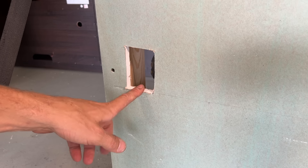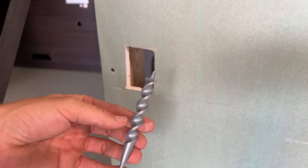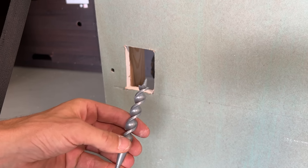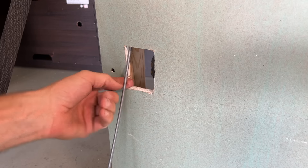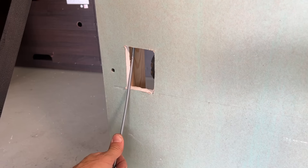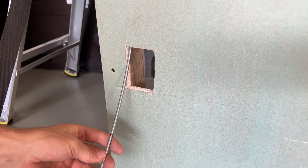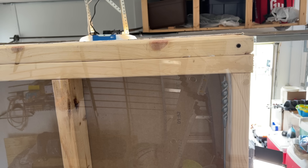For the first attempt, all I'm going to use is the access point here, which is the same size as a single gang electrical box. I'm using a Klein Tools 9/16-inch diameter auger bit with a screw point, which will help pull the bit through the wood. The first extension is 54 inches long, and then I have another 54-inch extension, which should give me plenty of overall length. I made a mark on this extension at 74 inches, which is where I'd expect to start hitting the blocking.